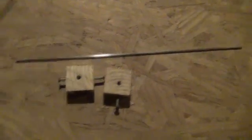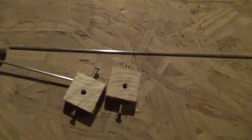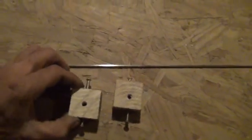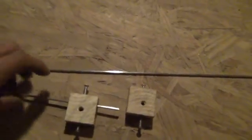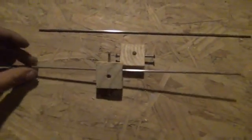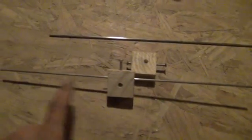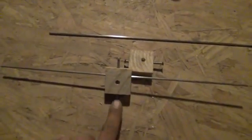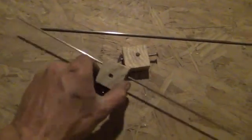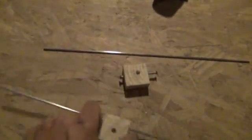Let me set that through there — doing this one-handed. There we go, it goes all the way through just like that. Once it's over the main drive pin, we set the top screw to hold the brush rod in place, then set the lower screw to lock our angle so we can get the right arc on either side.